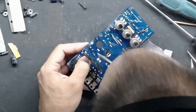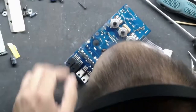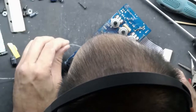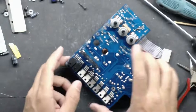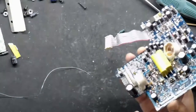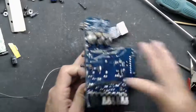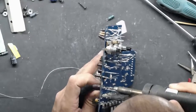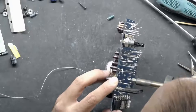I'm probably going to have to change tips in the solder sucker to get them. Oh, no — it fits. Lucky! For these larger pads, make sure you walk the iron around the pad to get the whole pad heated up — it definitely helps. That is everything under the transistors. Now we've got about four more caps and then we move on to the power supply.